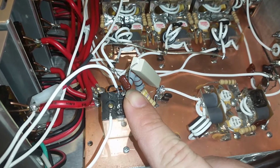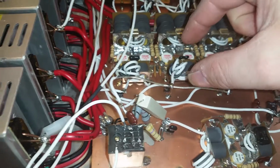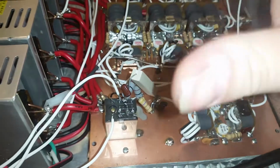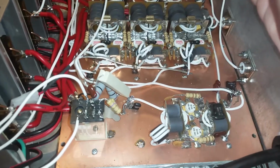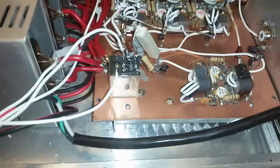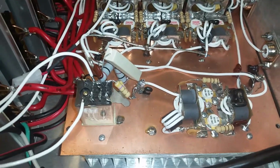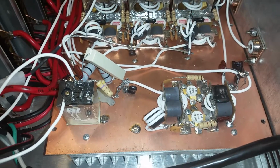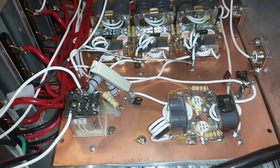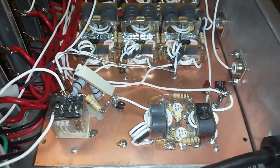So that right there shows you there is no DC making it through that cap to the output of these transformers, man. And for this to be AB or B biased, there has to be some sort of positive voltage, from the knowledge that I have right now sitting here. And I am always open for improvement. I am not on no high horse here. I undermine my own self to keep myself open for new knowledge. I'm always trying to grow in this thing, but I'm just going by what I understand at this moment.